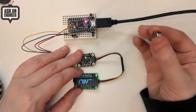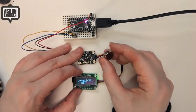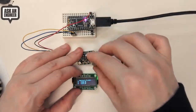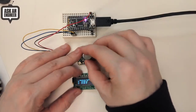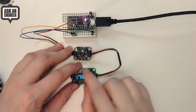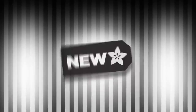It's originally designed for joystick applications — you put a magnet on a joystick and make a joystick with no mechanical connections. A regular potentiometer joystick eventually wears out, so this non-contact version is much more durable long-term. But it can also be used for general-purpose magnet detection in XYZ space from a couple of inches away. It's I2C so it works with CircuitPython and Python, and I'm just printing out the XYZ data over the OLED here.